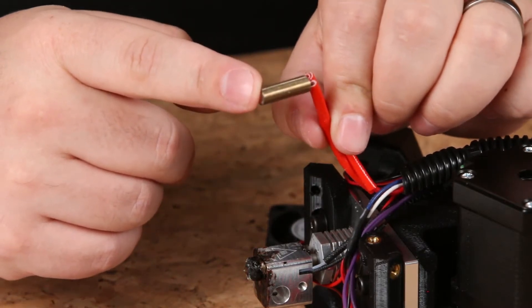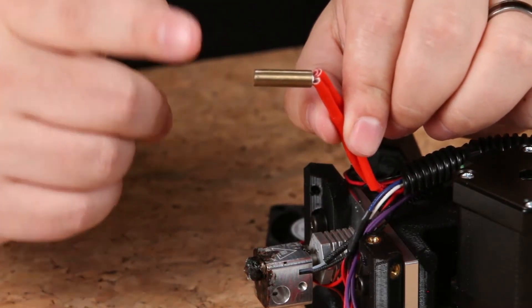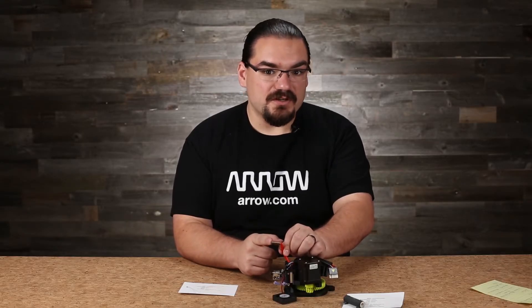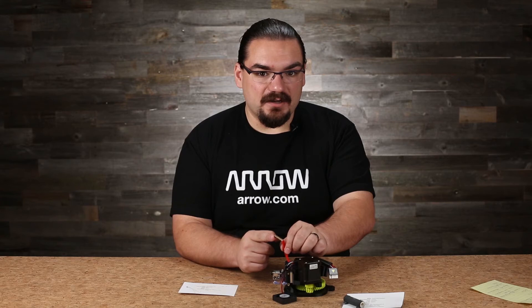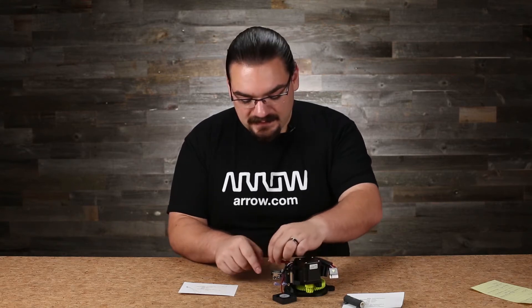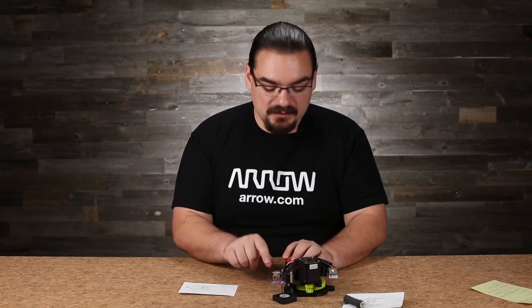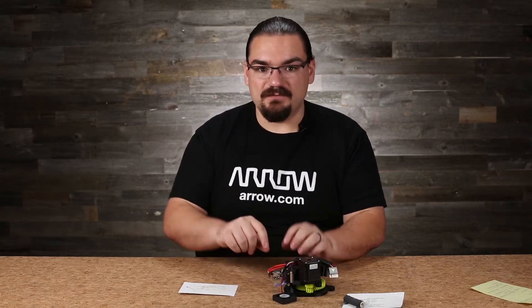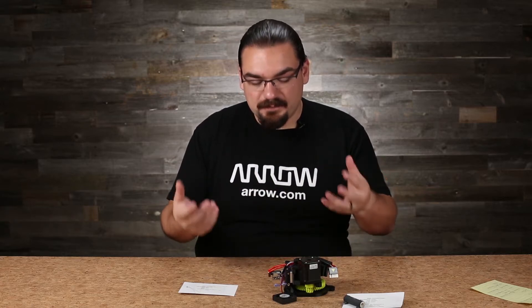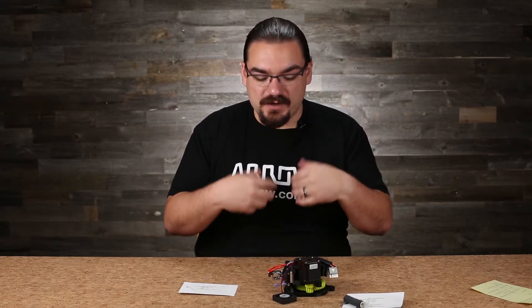What's interesting is that they actually on purpose undersize the resistors. This cartridge is rated for 24 volts, 30 watts, and since it's got an underrated resistor in there, what you're actually doing is heat sinking this resistor into this block. This block functions as a nice large heat sink to draw power away from the resistor and put all that heat into the material you're trying to extrude.